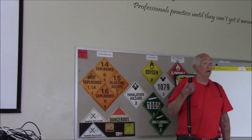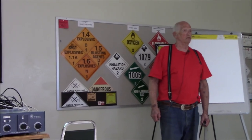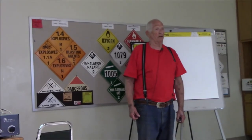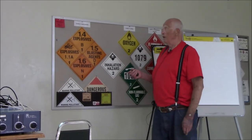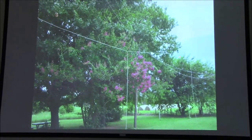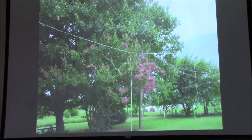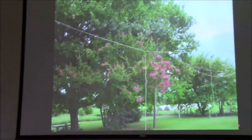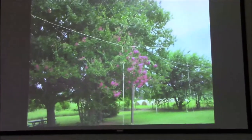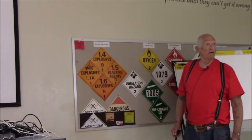And I don't know, it's the vertical, these two T antennas, on the whole, I think perform a lot better than my other antennas. I even considered taking a lot of the other ones down because these work better. Certainly they're quieter, the noise figure is much better. And the other thing I wanted to mention about them before I forget, is that we were talking about aperture before, and I think the reason these antennas are much better receiving antennas than my other antennas is this top wire across here spreads out the electrostatic field to the ground, and so in effect they have more aperture because the signals are noticeably stronger on the T antennas than they are on my other verticals or wire antennas.